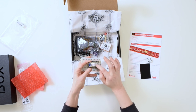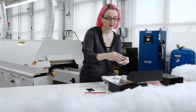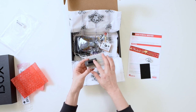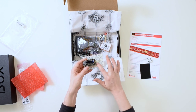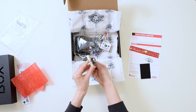You get 128 by 32 pixels, which means you can do little graphs, you can do text or icons. And what's nice is it plugs right on top. So for example, if you want to print out the current status or connectivity or battery level, you could display it on this OLED, but you still get all of this room over here. It doesn't take up any space on your breadboard. Super sweet.